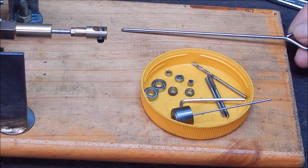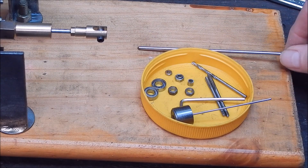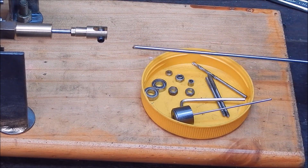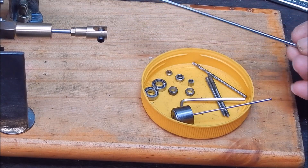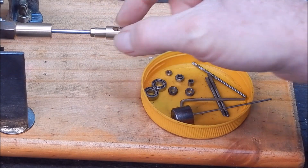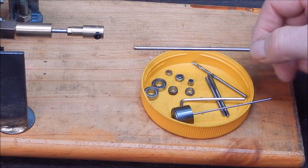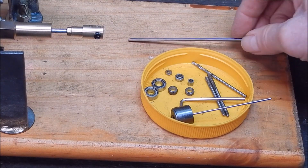Here are the bits we've got to finish the job - I'll come in close and explain what's in the Vegemite jar lid. This is a skewer from a Chinese gadget store - shish kebab skewers made of stainless steel, 3mm, very uniform. They will form the basis of the conrods and also the displacer cylinder rod. We'll make two conrods out of this stuff, one for each piston.